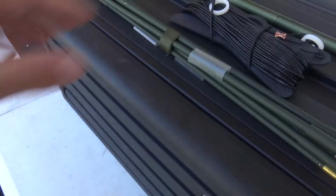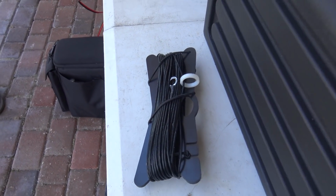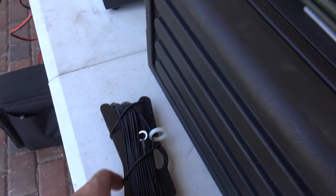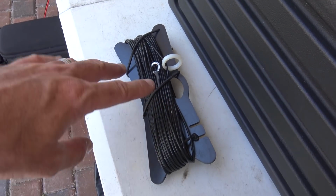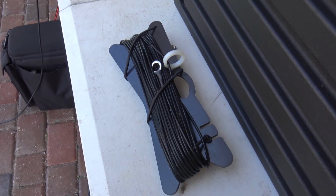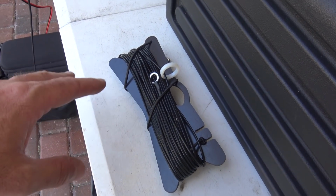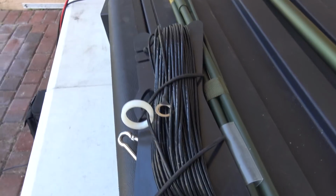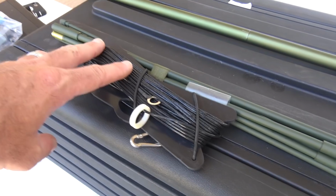And check this out. So when I was reading also this, John, this is the wire, the same type as the counterpoise, and the wire that, this is what we haven't set up yet for the inverted V, long wire and sloper. You can set this antenna up multiple different ways. This is, what do they call it, PTFE coax, or cable, or wire. This handles like from subarctic to boiling temperatures almost, and it does not shrink or expand with heat. It is not affected by sun, and that's the same stuff that they use, believe it or not, in airplanes. Because in your airplanes, you go way up in altitude, it gets hot, it gets cold. This stuff is not cheap wire, and that's not cheap coax. This is another reason why this antenna has the price tag that it does.